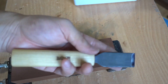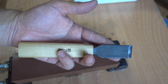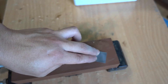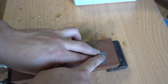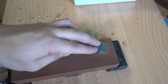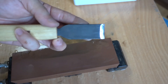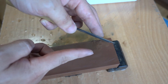I'm left-handed so I use my left hand. I grab it like this — two fingers like this — and grab it here, placing my index and middle fingers to the back of the blade. I place it like this and use the middle or index finger to help with pressure and consistency. The key to sharpening a good edge is that you don't wobble. Your hand motion needs to be very stable — flat against the stone — and do it consistently.